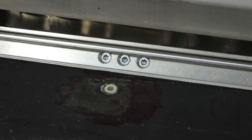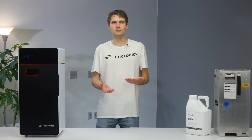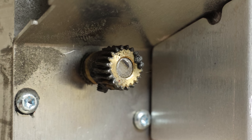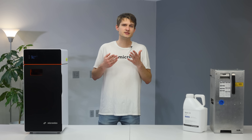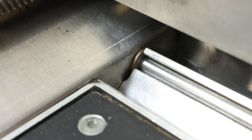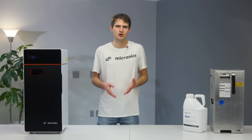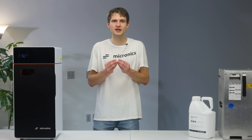Let's move on to the powder flipper, a critical component that has given us quite a bit of headache. The auger lifts powder, which is then evenly spread across the width of the build area by the flipper's rotation before being lifted to the build surface. When we first noticed re-coat failures, our gut reaction was to blame the gear driving the powder flipper, thinking it was skipping. But digging deeper, we uncovered a sneakier issue: during longer print jobs, some powder particles were getting in between the shaft and the bushings, causing the flipper to bind and fail to lift the powder. This led to the printer detecting a re-coat fault and stopping the print. While it might seem like a trivial oversight, it's precisely these kinds of problems that beta testing is meant to catch.